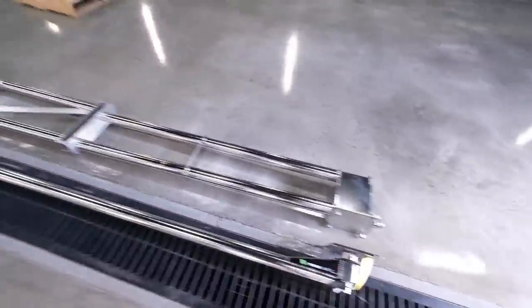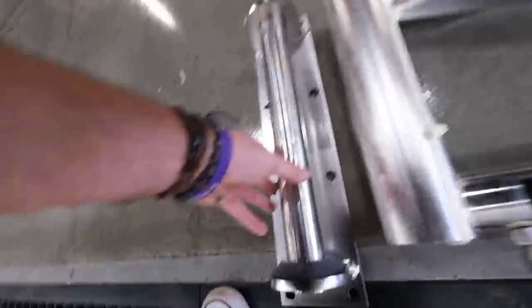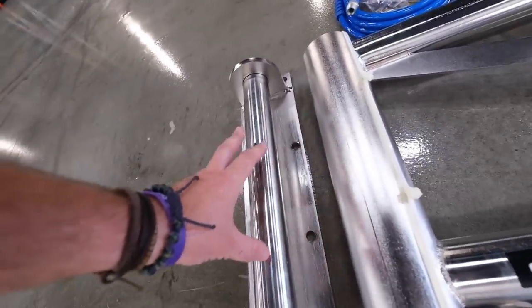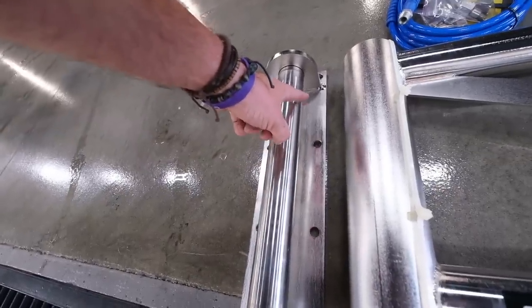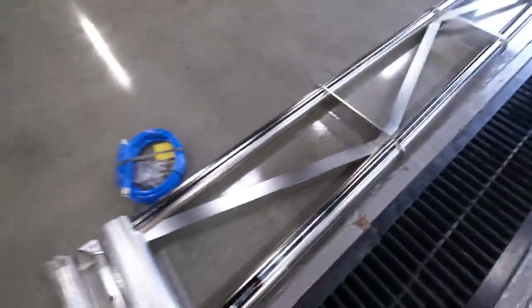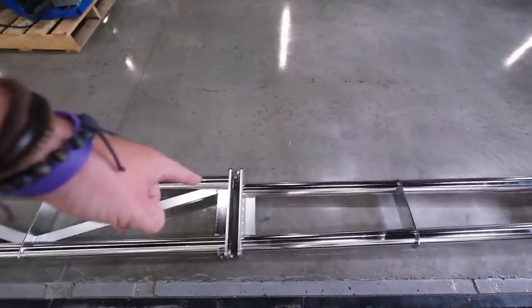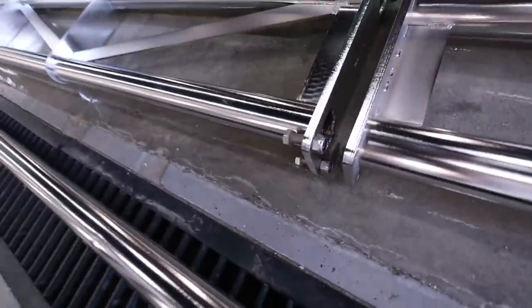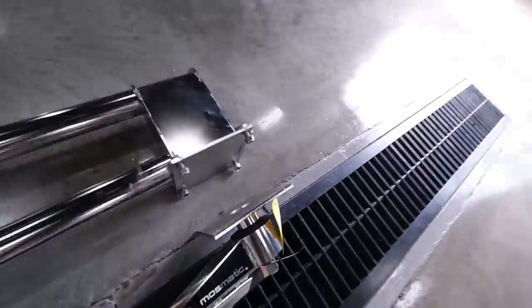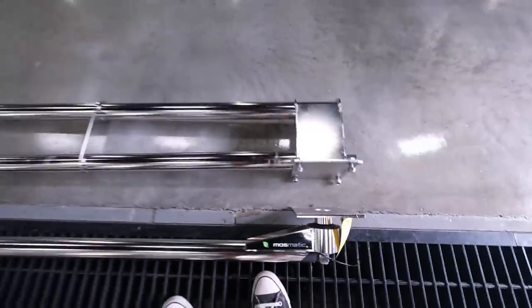This thing is crazy — fully stainless steel. So this is kind of how it'll look up on the wall. This over here is the mount. This thing is going to go on first. This pin slides through this sleeve here. Once you mount this, then you can bring this up and slip it in super easily. I have to get this whole pattern up into the beam above and bolt this thing down. Once that's in place, we put the first extension on. It's like a five-foot extension — the bolt's on right here, and all the nuts and bolts are included. They're all stainless. Then once that's in place, the ceiling boom will mount to the end of the extension and swivel 360 degrees from there.